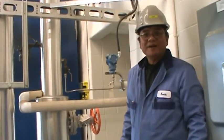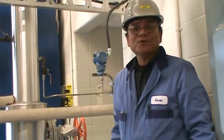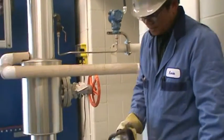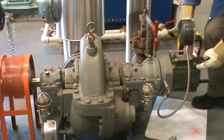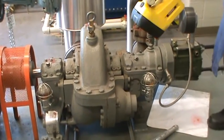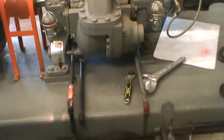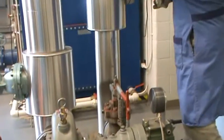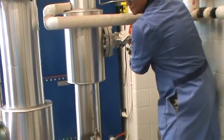Hi, my name is Kevin. Today I'm going to show you how to start a steam turbine and put the load on. Before we start, we have to put the auxiliary equipment on first — that means the condenser, the cooling tower, and the water pump. We also have to make sure the oil and the governor is okay, the oil for the bearings is okay, and the drain of the turbine has to be open to let the water out.